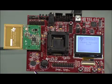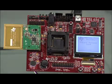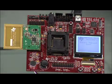Example code is currently available for the MSP-EXP430F5438 experimenters board and the Stellaris LM3S9B96 development kit. The MSP430F5438 experimenters board will run in the polling mode upon power-up. When a 15693 tag is within range of the antenna, the unique ID and RSSI values are displayed on the LCD and LED1 will illuminate.